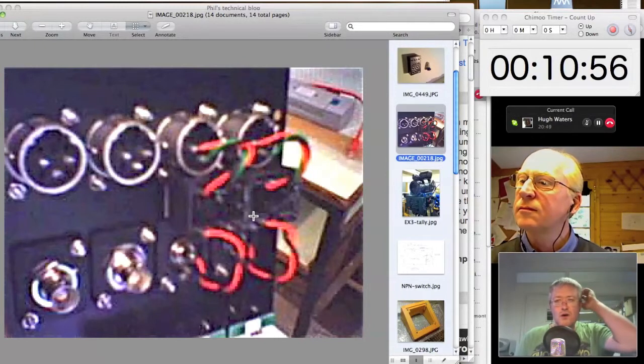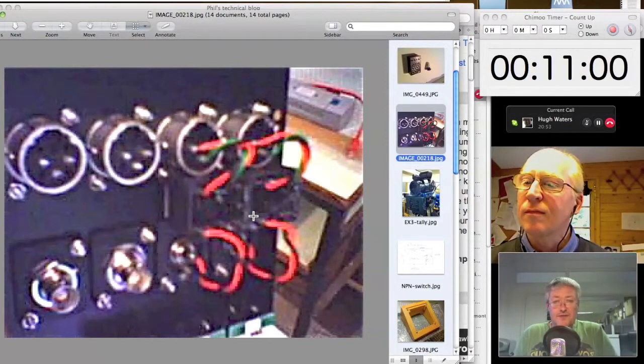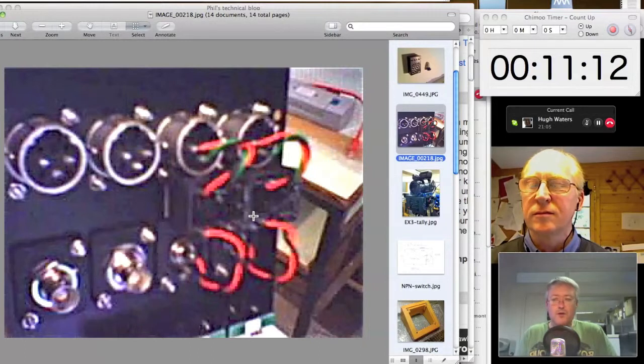What's often a very useful thing to have in a room is, say it's going to be an Avid suite or an assignable room of some sort. Typically you'll want the stereo monitoring output from the Avid coming back on some tie lines. And you'll want to put that up on some PPMs and maybe even on a more elaborate audio monitoring device. But you'll also often want to feed that into either an amplifier that's got unbalanced inputs, or maybe you've got a DVD recorder in the room and you want to feed that as well with Avid.